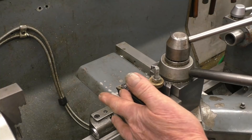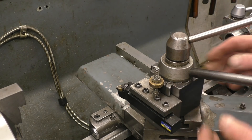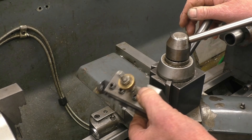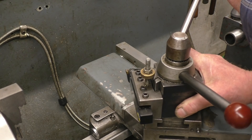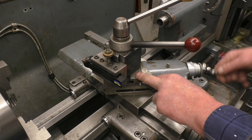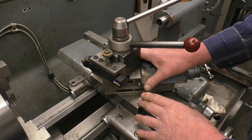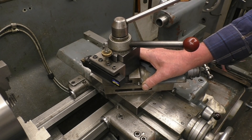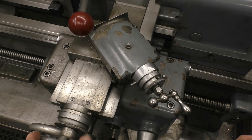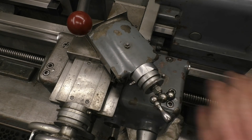That's the tool — actually a right-hand knife tool — that's the tool holder, and this is the tool post. You can take this off and put different tools on very quickly; it saves messing around with shims. You can turn the angle of that to whatever you need. The tool holder and tool post are fastened onto a compound slide. This can be set at any angle — it's used for cutting tapers as well as being useful for screw cutting. The compound slide is attached to the cross slide, which goes back and forward across the lathe for facing cuts. The hand wheels on the compound and the cross slide have graduations on them, so you know how much you're feeding in and how much you're taking off per cut.